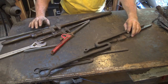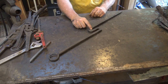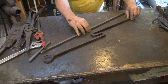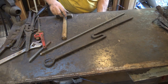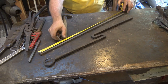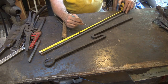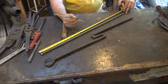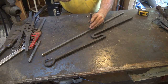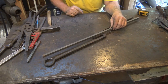Let's stick with something a little more traditional and make a wrench like this. This one is two sizes — it'll twist five-eighths material here and half-inch material there. Today we should make one that will twist half and three-eighths material. Half and three-eighths are two very common sizes, so it'd be a good size for a wrench. I have a piece of half-inch bar stock — for the five-eighths wrench I use five-eighths bar stock. I always start with stock at least the size of the larger piece I'll twist. This is 30 inches long, so I'll simply make a mark at the center and center punch that.